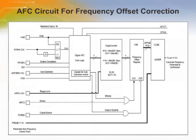The AFC block operates in two modes depending on the strobe signals, which are governed by the MFCS bit: manual mode and automatic mode. In automatic mode, the strobe signal from the microcontroller is not required to update the frequency offset register block. The AFC circuit is automatically enabled when the DIO indicates a potential incoming signal during the entire measurement cycle and measures the same result in two subsequent cycles. Without AFC, the transmitter and receiver need to be tuned precisely to the same frequency.